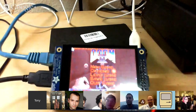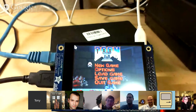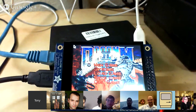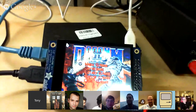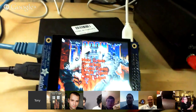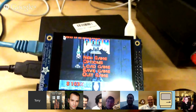Does it run Doom? Does it run Linux? It's the same — one in the same. The nice thing is with the Raspberry Pi, because it's such a small display and a slower processor, it gives you the authentic experience of what it was like to play on a 486 back in the day. You can overclock the Pi — I overclocked it to 900 megahertz for the game girl, which gives a 10-20% increase. Thank you so much, Tony.